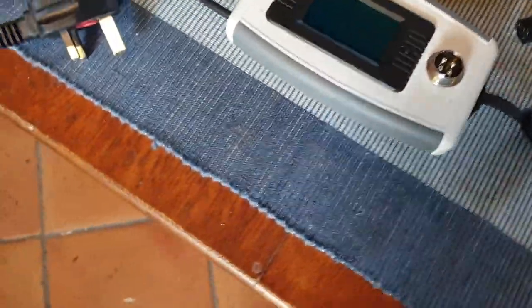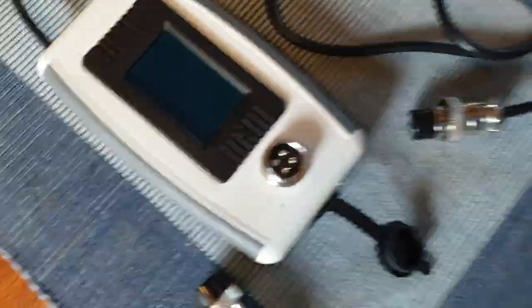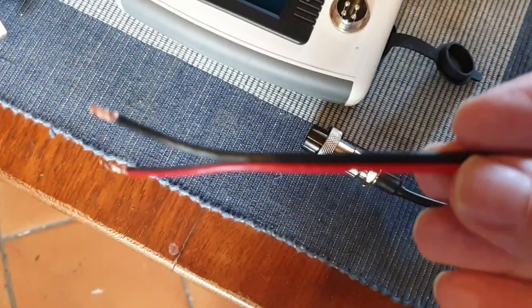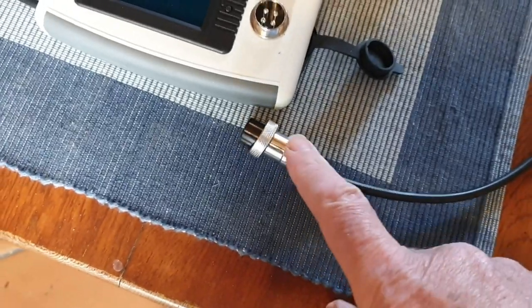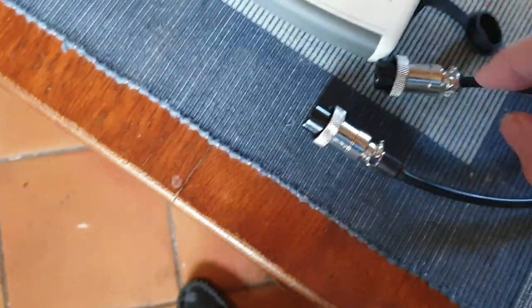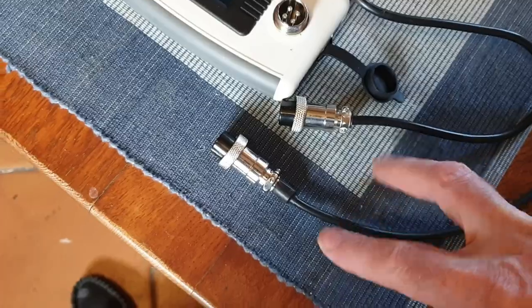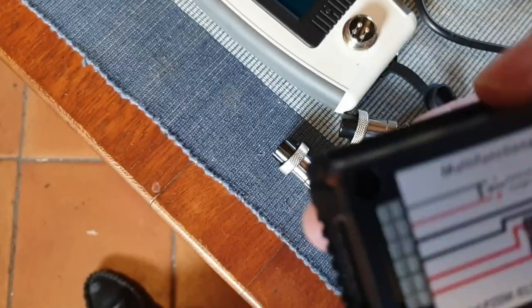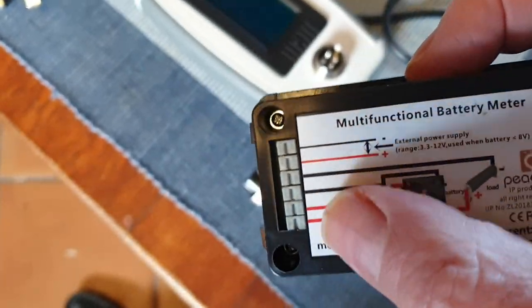You need some wire to wire it up — just make sure it's good for the current you're using. You want to wire pins 1 and 4 on both connectors, so they're wired the same although one's a socket and one's a plug. Each of the two wires on each of these goes to the connector on the back, so it shows you the wires to the connector.